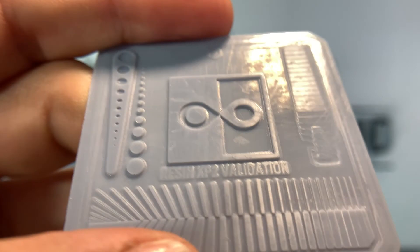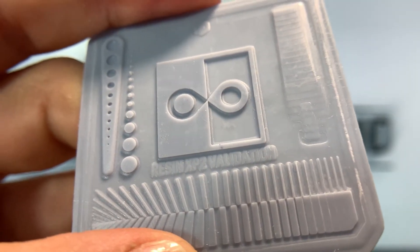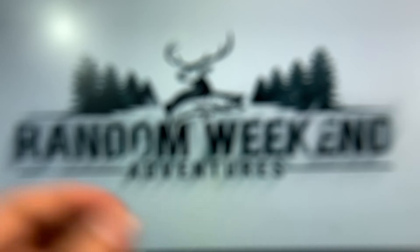So by far, 1.2 seconds is about exactly where I want to be. But I went ahead and printed off a miniature at 1.1 seconds, because I felt like that was sort of a happy medium between 1.0 and 1.2 seconds, and that's what's currently printing. Once that's all finished up, I will compare it to the Anycubic gray resin, which I printed at the exact same settings — just with the proper exposure time I found doing this exact same test with that resin.